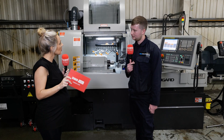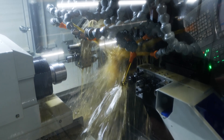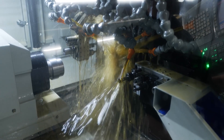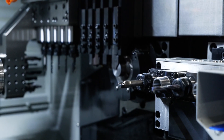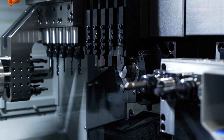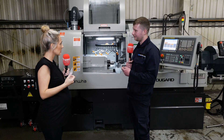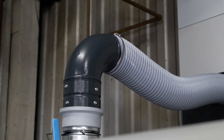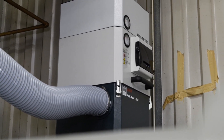There's been something that's impressed you with the tool life here too? Yes, the tool life. The coolant flow on this machine is really good — it's got a load of pipes on there and you can move them about. So that helps the tip wear; it's not warming up the insert, not breaking the insert as quick. The coolant flow is cooling it down. And the mist filter is really good for the atmosphere — when I'm cutting material and the coolant's cooling it down, it goes straight up into the mist filter so I'm not breathing it in.